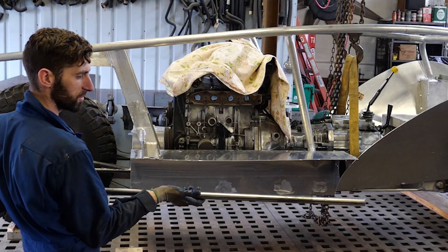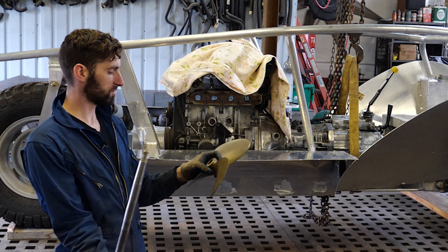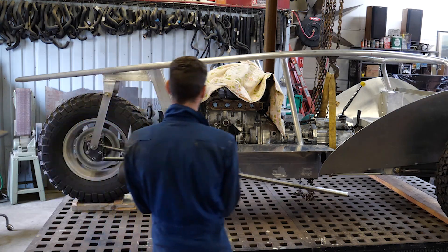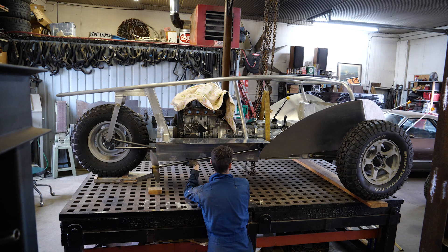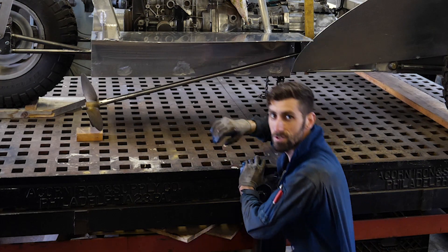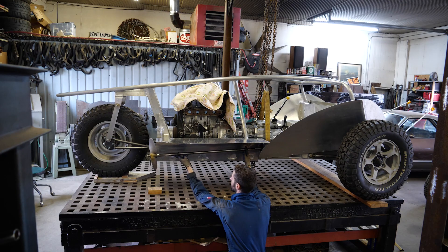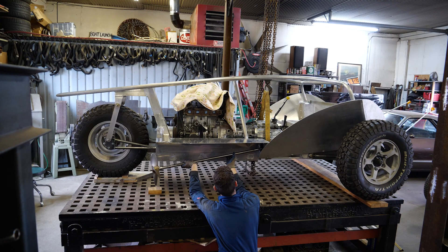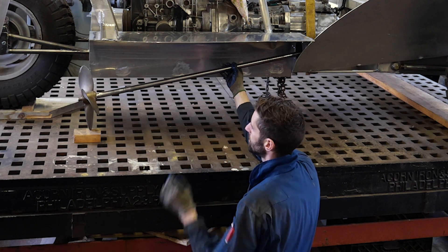These are the propeller shafts — one inch stainless steel, off an old boat. These are propellers I'm gonna try to use. They're 13-12s: 13 inches around, 12 inch pitch. The plan is to mount these right in here. I was hoping to have an articulating up-and-down mechanism to adjust the height of the propeller, because the bottom of the boat is about here. If you ever want to achieve planing on the surface of the water, you're gonna have to have the surface of the water about here. The thought was you lower this just to get a good bite in the water, so the propeller is still mostly in the water when you're up at speed.